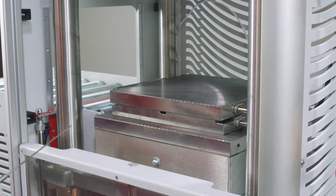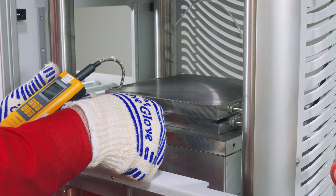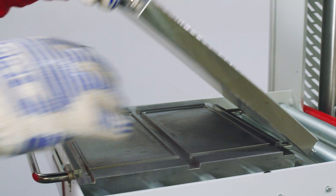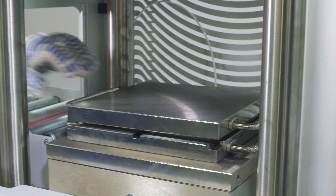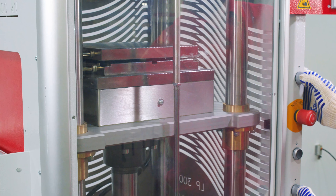Following ASTM and ISO guidelines we will verify the mold temperature by inserting a thermocouple into the grooves. Next we will remove the mold from the platens and insert the rubber preforms, then place the mold back into the press in the minimum time possible to prevent the mold from cooling. Press the start buttons on the press to close the platens and begin the cure cycle.